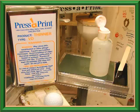There's lots of epoxy in this golf ball ink. It's really gluey, so we make the ink rather thin to compensate. It would be frustrating if the ink is too thick, but using a consistency of light table syrup, the ink flows very smoothly, and by adding a few more dribbles of thinner as we go, the ink will continue to flow nicely for the couple hours that this job will take us.